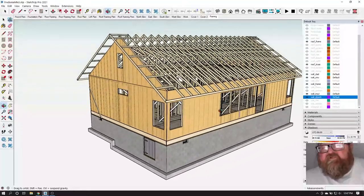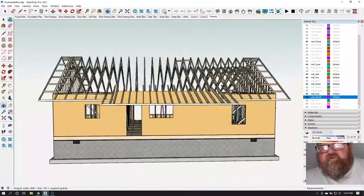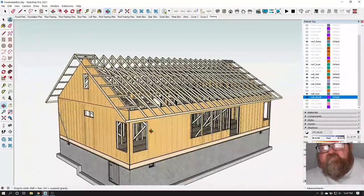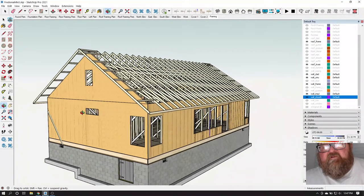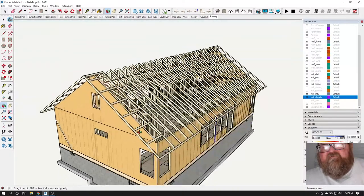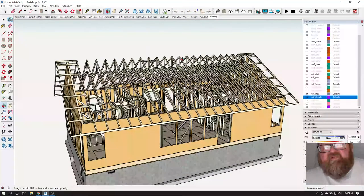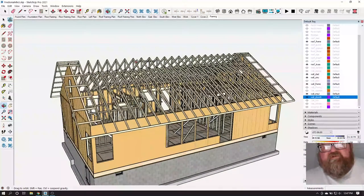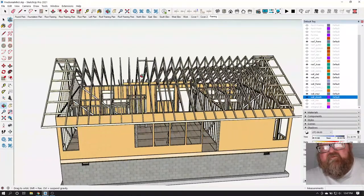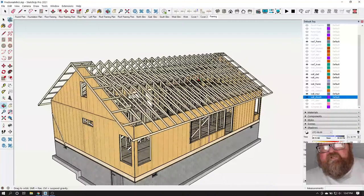The wall sheeting — you don't have to cut the windows and doors out yet, we normally do that later — but having the wall sheeting on helps stiffen up the walls and brace the house while you're setting your trusses. I'll get a boom lift, set five or six trusses at a time up here, and they'll come up and jar the house around. The whole process of setting trusses will shake and move the house around.